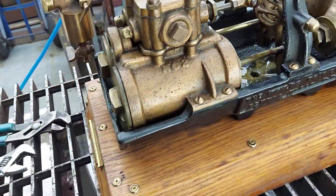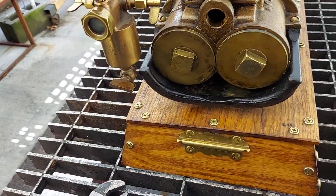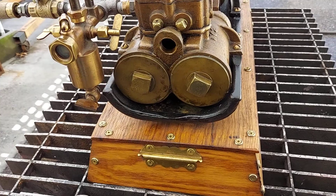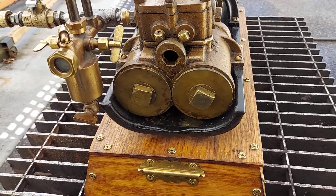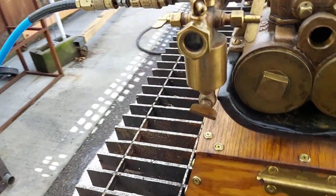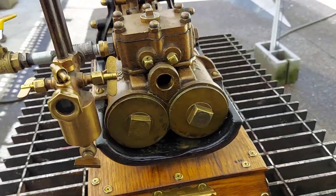I've changed the pistons over to brass pistons in here, 2 and a half inch diameter, with high-heat O-rings on them for steam. And I've added this really nice swift oiler here — it's the tiniest one that they build. Seems appropriate for it.